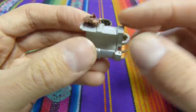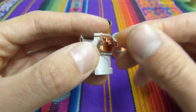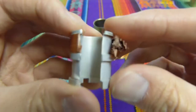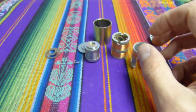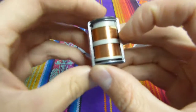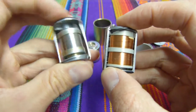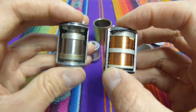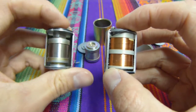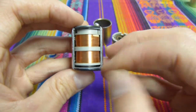Now we can take a close-up look at the coil — I have one that I've dismantled here. You can see the inertial mass and then the coil that's wound around it. This coil is made of copper; it's very fine. To actually see how things work, this is the best right here. The magnet, which you see on the left-hand side, is fixed in position. What actually moves inside the geophone is the inertial mass, which has the springs on the top and the bottom.